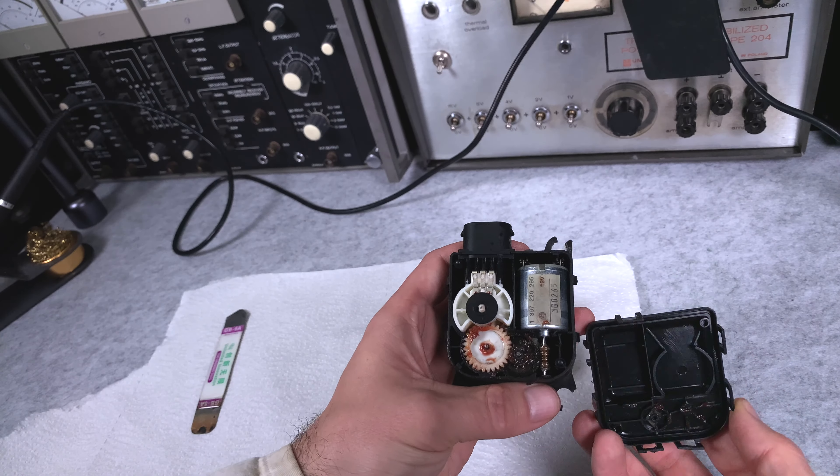It's going to be sending voltage, dividing it, and reading the value. With very simple logic - for example, if we set 5 volts on those two ends and read 2.5V in the middle, the computer is going to know that the flap is set to 50%. These are not the actual values but that's the idea. You've got a feedback loop that tells you where the position is located.